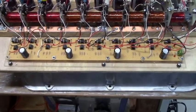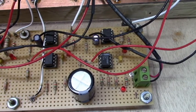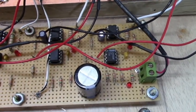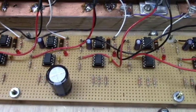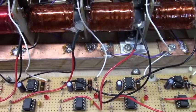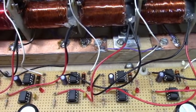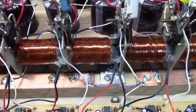The first thing I did was make a new drive board. I'm using the LM311 comparator and the TC4422 driver chip on each stage. I'm using an Osram photodiode and they give a real nice output, real nice response. It's a major improvement over the phototransistors that I was using. The infrared emitters are still the same.